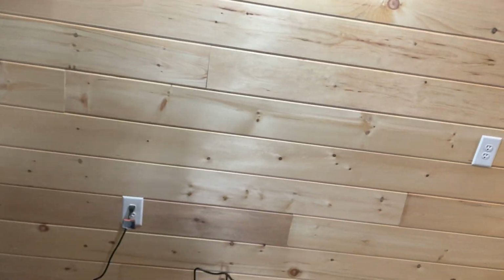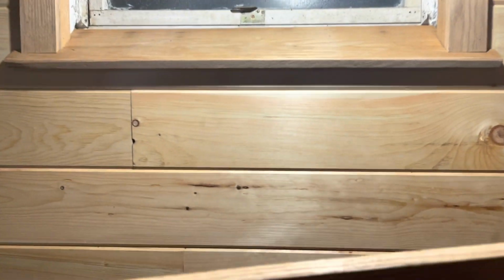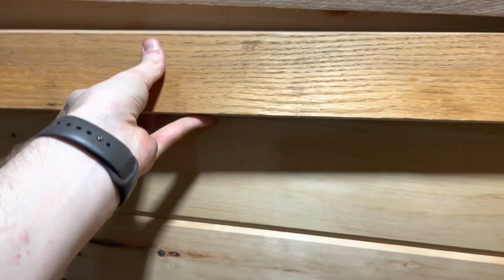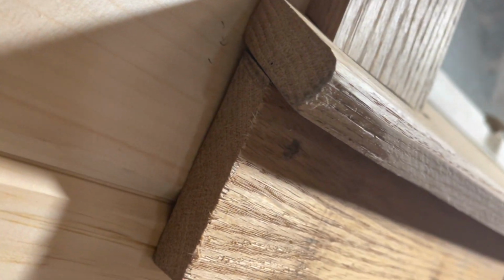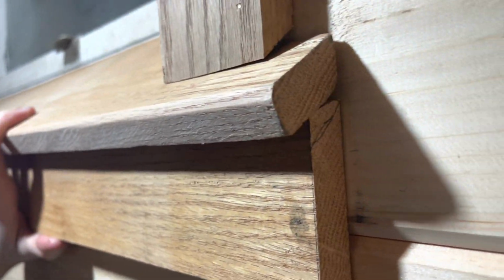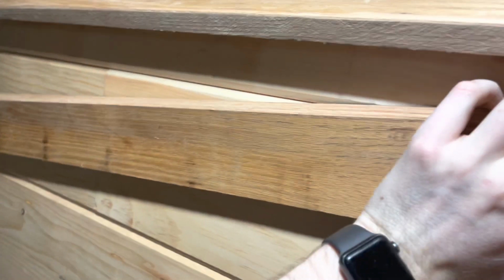All right, so as you might imagine, this goes this way with the bevel facing me. And it sits just under there. And we're pretty close, but not quite. Check the other side. Don't have enough hands. Well, that side's just almost perfect. So a little bit more off of this bottom side. This board's a little bowed also, so yeah, quite a bit more off this bottom side and a little bit off that one, and should be good.